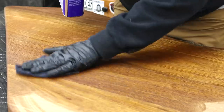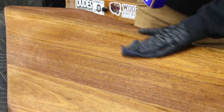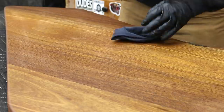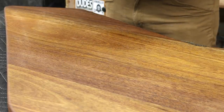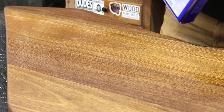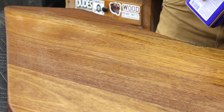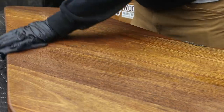There's a little bit of paint down in there. So I think I can just use a brown filler. It looked like they used that red filler before that was probably a little bit too red for this piece. So I will dig that out and put in the brown. I just have a light brown filler. It'll look nice. It ought to match.